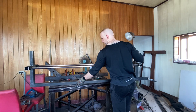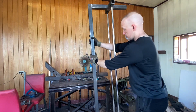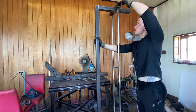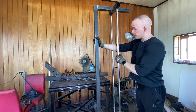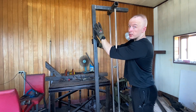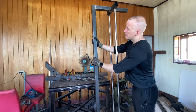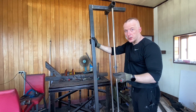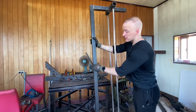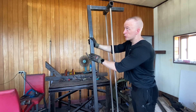I'll stand this up — and there we go. That's basically how it's going to look. This is two meters high, so it's a bit taller than me. It's got the rails here. The weight will slide up and down, it's going to be plate-loaded at the bottom. Initially the idea was to have a pulley up top and a pulley down low. But the fact that I have this nice long clean post makes me consider having an adjustable pulley system. However, this is one of those parts where you need to make up your mind ahead of time — making an adjustable pulley system would mean drilling holes on both sides of this tube and building a slider around it. All of which would have been infinitely faster and easier if I'd done it when it was just a plain tube and not welded and attached to all this stuff.